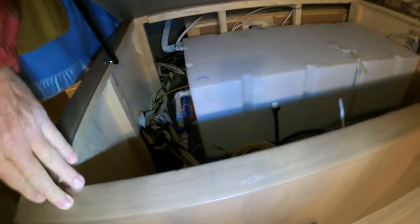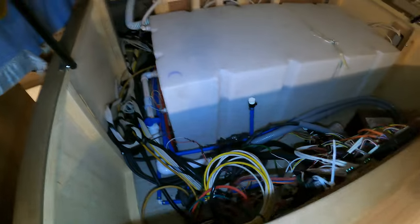We gotta go inside. Before we really start into the process of how to blow out RV water lines with an air compressor, the first thing we want to do is get the water out of the system using gravity. And the very first thing we need to do is drain our main water tank. Now our main water tank is under the master bed, and there's this big conglomeration of stuff.